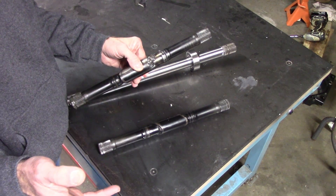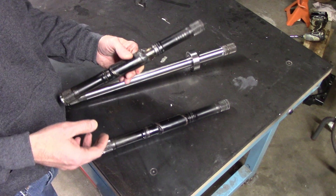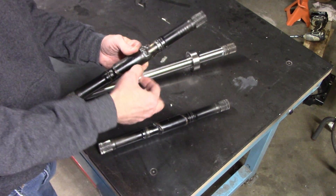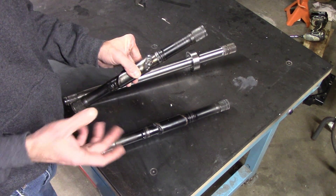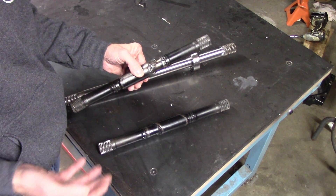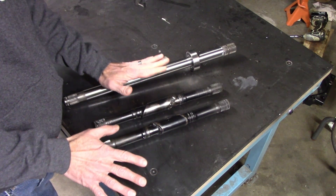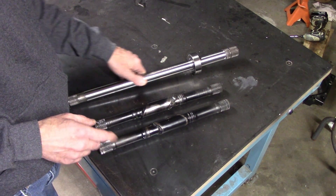It's not meant to be an all-wheel drive garage queen. It's meant to be an all-wheel drive car that I take to the track, beat on, and drive to work. I was doing clutch dumps in my driveway and this axle actually broke. Luckily, since it's a tube over two sides, I didn't even notice it at first — I drove it up and down the street and probably could have driven it a long ways. It wasn't until the next clutch dump that the back tires started spinning and I realized I didn't have all-wheel drive. The original intention was always to replace these, so the first goal is to make the jack shaft — the cross shaft that goes through the oil pan.